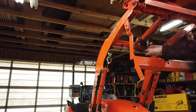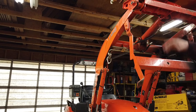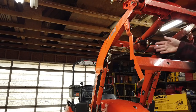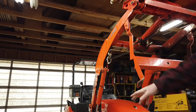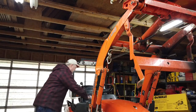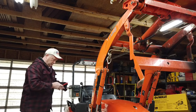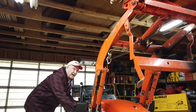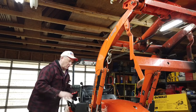Now what I'm going to do is lower the front end loader. I'll get back on the operator station and I'll remove the hydraulic lines. I'll undo a couple sticks down here, remove that, and then back the tractor away.